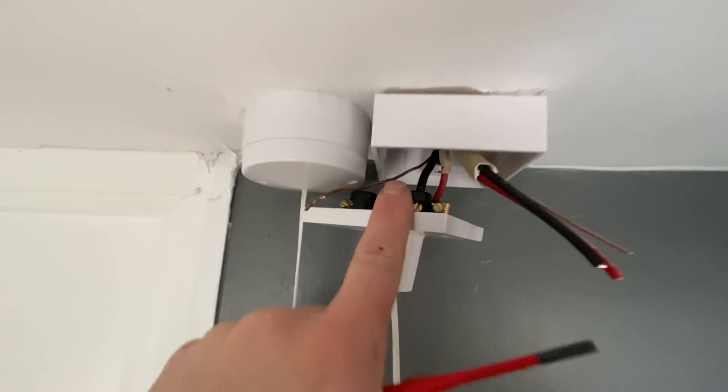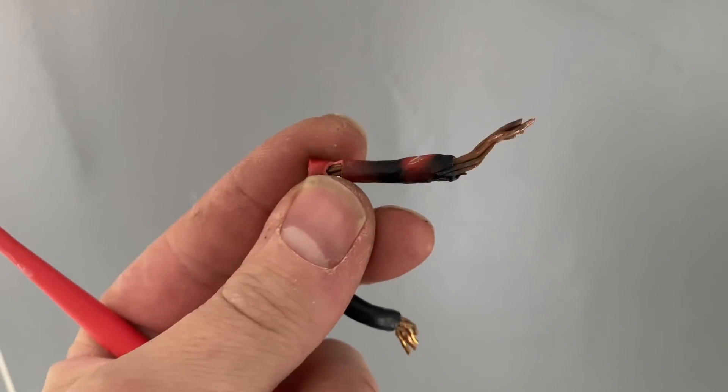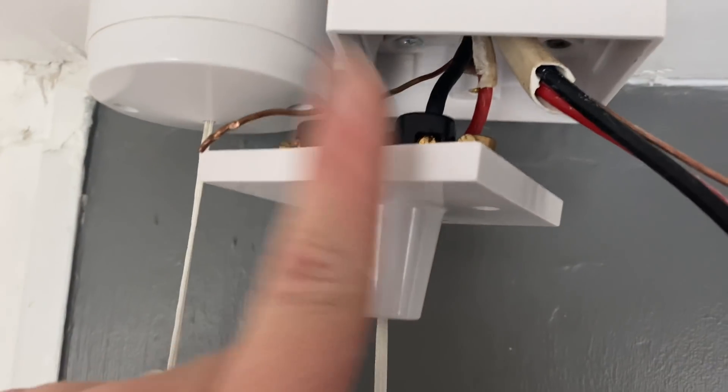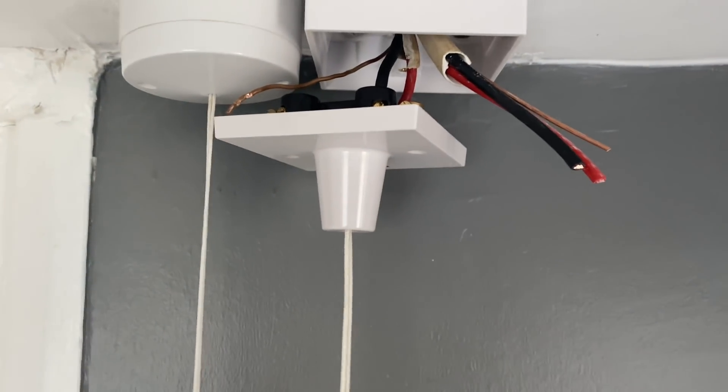We just had to check this because when we turn the shower on, the fan comes on. This is pretty standard shower connections — completely burnt out. It was loose. So I'm remaking it. And I'm guessing we're going to have to go in the loft now and check why the fan is coming on with the shower — it's a joint somewhere.